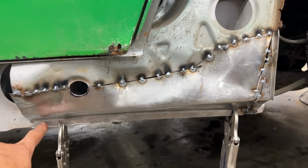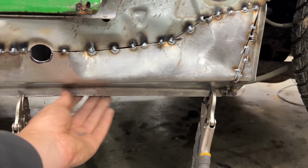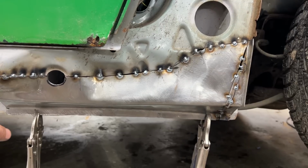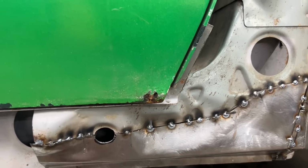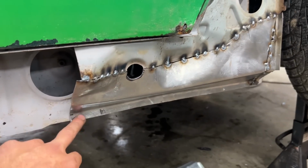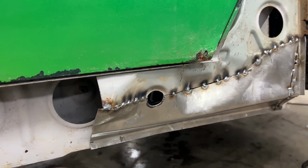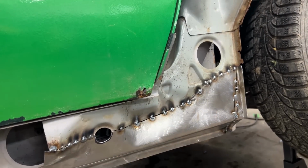However, I forgot something. I forgot to drill the holes for the plug welds. And I don't think the spot welder is gonna work here. Maybe I can try, but if it doesn't work, then I'm gonna have to drill holes. But I didn't even paint inside, which was stupid of me. So now I'm gonna have to release this a little bit and just, wow, that's solid now. Anyway, there's still room, so we can spray from inside, from here, and I can reach pretty deep on this side and then on that side. So we're gonna spray a little bit of paint, and you know what, it's best if we drill holes, and we can drill holes from here even without going through the second piece. Actually, there's a second and third piece, so even if we drill through the second, we're not gonna drill through the third piece. So we're gonna make these holes, and then Nicola is gonna weld it in full.